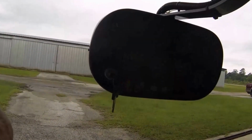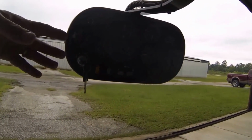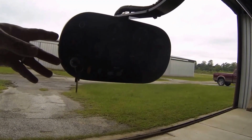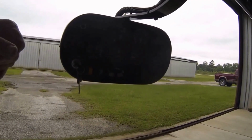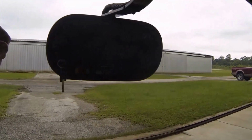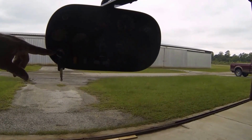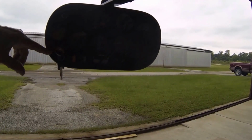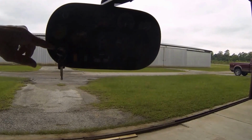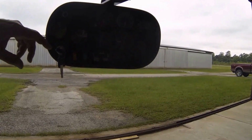So a lot of the things that don't come with it. Well, none of this comes with the airplane. For about almost 2 years before I got the kit, I designed and decided what it is I wanted on my panel. So here's the fuel gauge. This is the ignition switch: off, right, left, both, and start. There's 2 cylinders in the engine. Each one has 2 spark plugs. One is on the right side, one's on the left side, and you can test each one.